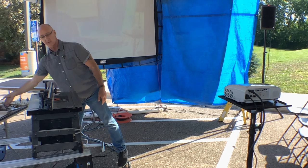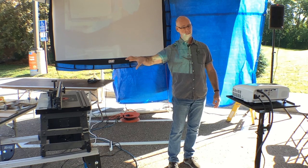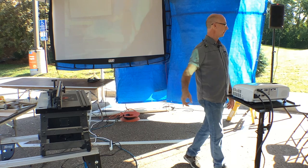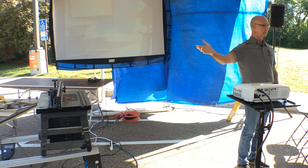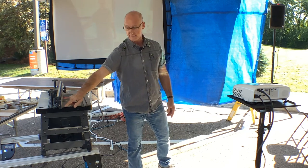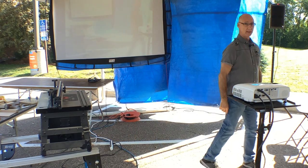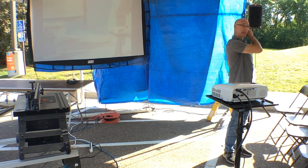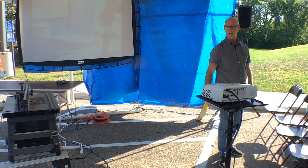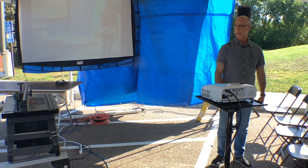I know people get funny about this because you're cutting into your router table fence, but on a good router table, those fences are interchangeable and flippable. So you actually have eight corners you can cut into, so you can zero clearance it eight times. And then, clearly these faces are longer than what I need, so if it gets real chewed up, you just go to a miter saw, cut an end off, and you start all over again. Generally, those faces are 3/4 inch thick material, so if you cut them, which is where I'm at on my table in my shop, then I just replace them with melamine fences, and you're right back to where you started.